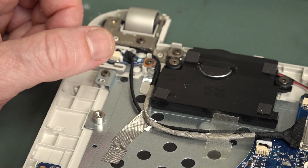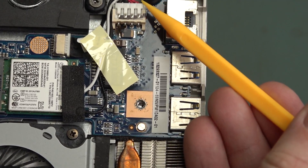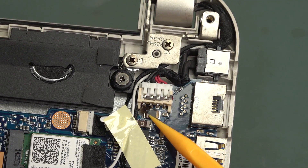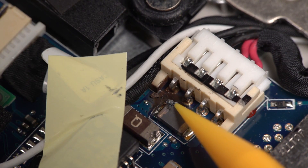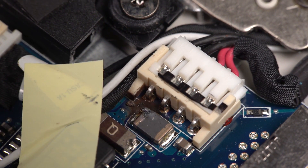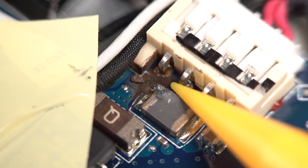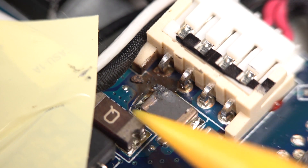Where's our DC input? There it is, all the way up there with a little cable. They didn't bother soldering it in, which is nice — you could salvage it as a separate assembly if you buggered up your input connector and wouldn't have to re-solder. Hello — I see a burn mark there. Let me get the macro lens out. That's burnt right out. Wow, somebody had fun. Hopefully you can see that it's all burnt around there — that's on the negative side.